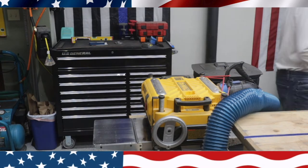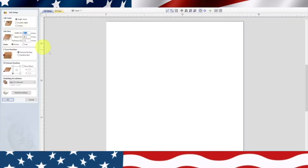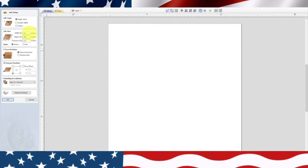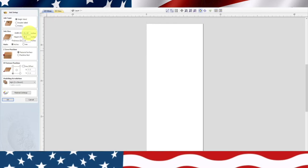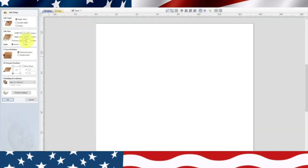This was actually a tight fit going through there. Once I get it all nice and smooth it was time to take it over to the CNC machine. We'll create a new file and enter our dimensions — I'm really trying to do these dimensions perfect so everything is centered on the project. Width is 15.3125, height is 12.9375, and thickness measured with calipers is 1.5860. The thickness is one of the more important things. We don't need high resolution, so we'll do standard and hit OK.